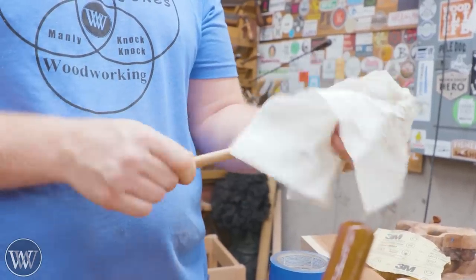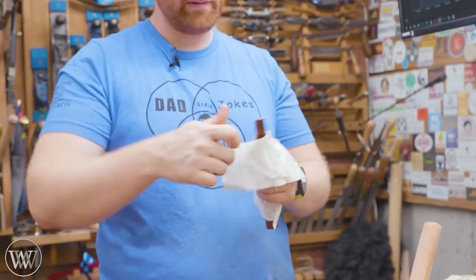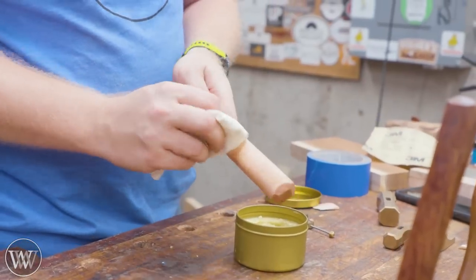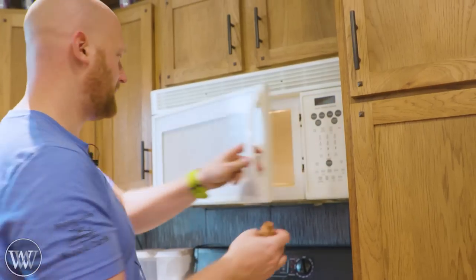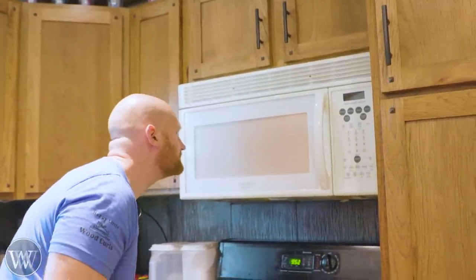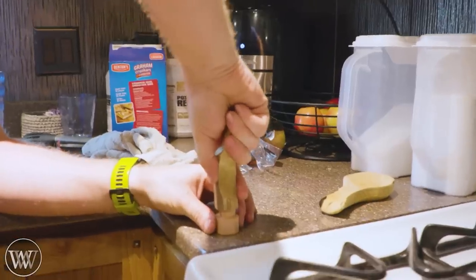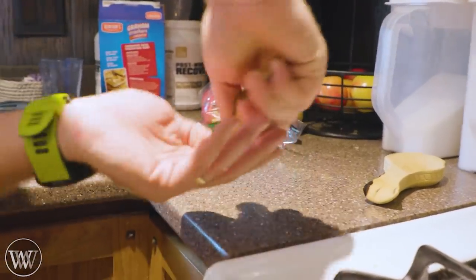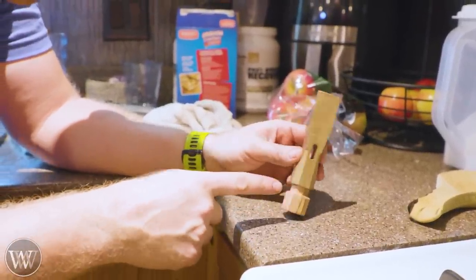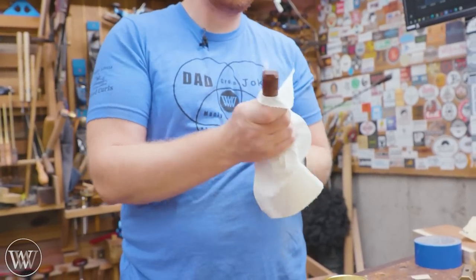There's the shape of three handles - now we come in and wipe it off. For the paste wax, I'm actually going to use the stuff that I make and sell here in the shop - a softer recipe I really like. It's boiled linseed oil, beeswax, and a little bit of mineral spirits to cure it out. For the face, we're going to put it in the microwave for a while and let it fully dry out. If I had more time I'd put it in the oven for a couple hours at over boiling temperature - that actually sucks the moisture out of it, the whole thing shrinks down. At that point you can drive it down onto the head, and it will absorb moisture in the future and swell up to fill it, locking in there nicely without any glue.